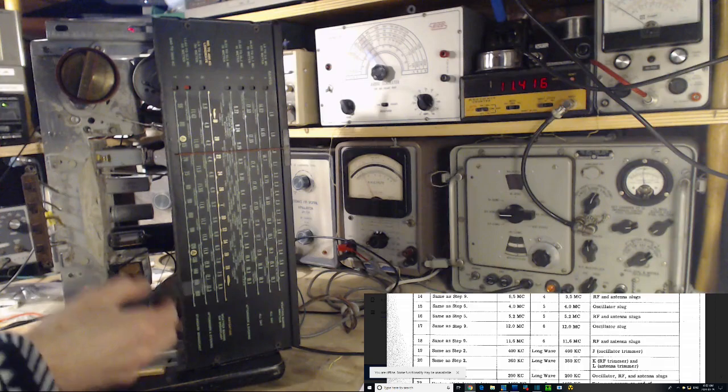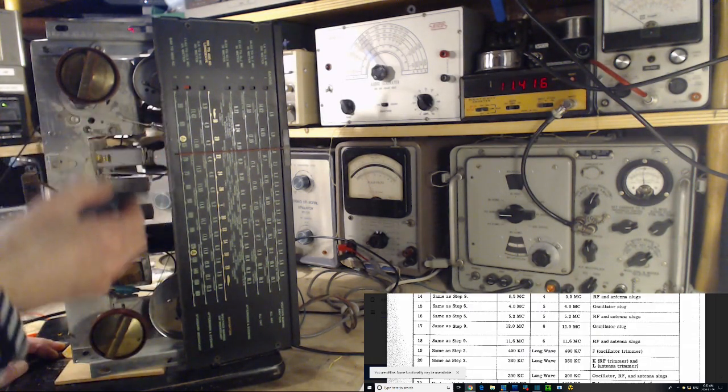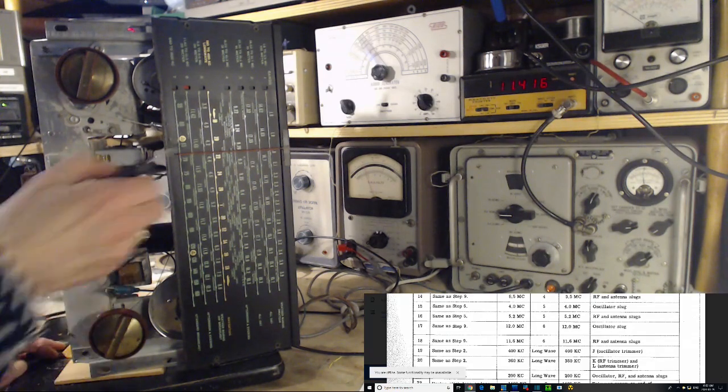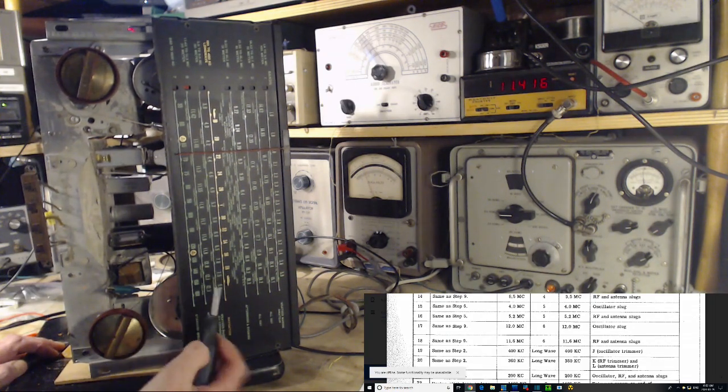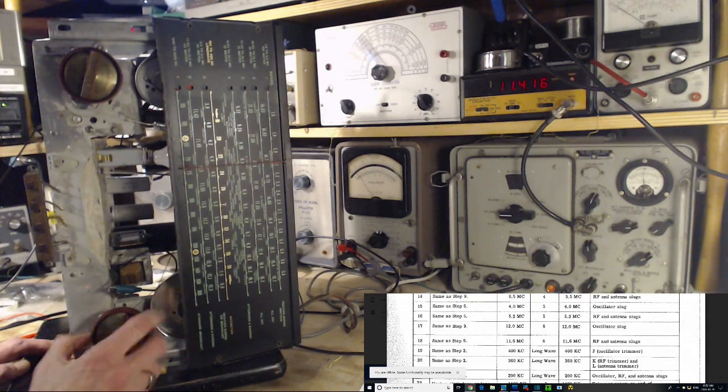There's not much up here. This is not a broadcast band up around 12. It's in this area. So I should really want the radio to be more accurate in this area, regardless of the fact that it's told me to do the adjustment at 12. What if we do the oscillator at 11.5? Okay, so there's 11.5.